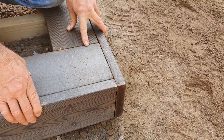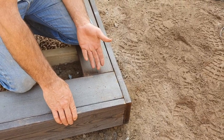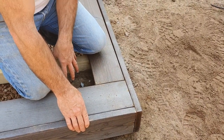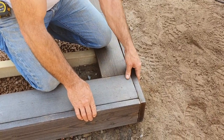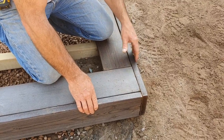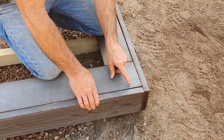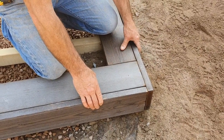I've cut these at a 90 degree again, not a 45, because I think it just looks better. There's going to be a lot of cuts at 45 in the decked area anyway. Where you look at these, where there's a little chip, or where the decking is rubbed during transit, with a Rubio Monocoat, which is on the surface here, it's like a cream, we'll go over that, and you just won't see any of that at all. So that's the look that we're going for.